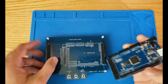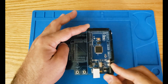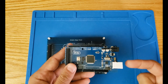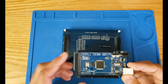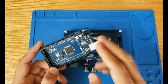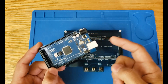I could have designed the board differently — for example, oriented it vertically instead of horizontally — but I wanted the module to fit with the rest of the modules, and I really wanted the USB port on this side so it's more natural and easier to connect. Another cool thing about this module is that it actually provides power during testing, meaning you don't need any external power supply. The 5V output from the Arduino Mega will be used by the rest of the modules in the computer, and you can power up everything through this USB port.